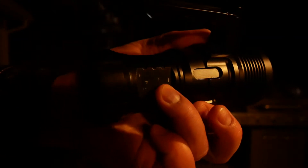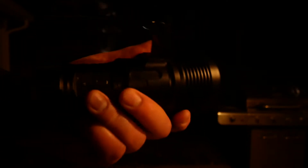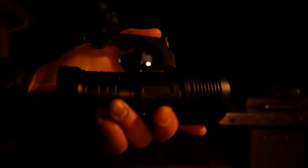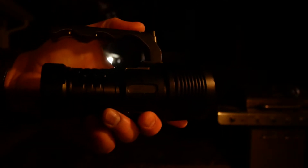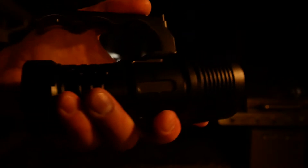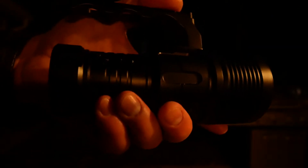Hello YouTube, Dee Baudry here. So this is a Surefire, I think. There used to be a silkscreen label right there that said what the flashlight manufacturer was. Anyway, a long time ago, back when I first started messing with XHP 70.2 LEDs, I replaced the very blue Chinese LED with a legit Cree XHP 70.2. It's not overdriven in any way — totally factory voltages, factory driver board, everything. Just a better LED, which made the light much more yellow and also a lot brighter.